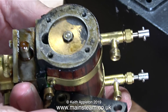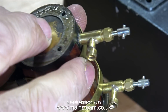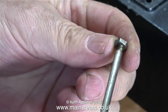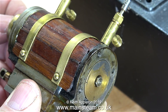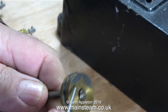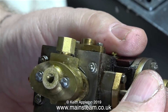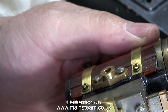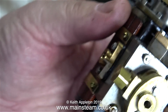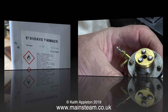I'm wondering what the piston fit is like - it slides up and down in the cylinder a little too easily and there's a bit of side play too. These engines can have piston rings made from cast iron, alternatively fitted with a silicone O-ring as a piston ring, or even soft packings which is just graphite yarn. There's nothing wrong with soft packings for pistons in steam engine cylinders, but as a general rule if you're using soft packings the piston has to be a good fit in the cylinder. This thing on the steam chest is really a governor assembly but nobody has fitted a governor to it - I have a couple of quite nice microcosm governors so I might fit one to this engine on a pedestal at the side, more like full-size practice.